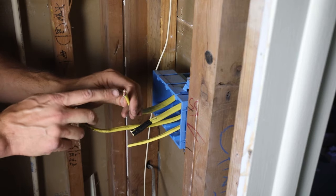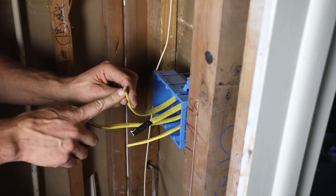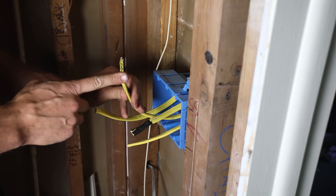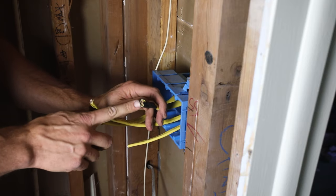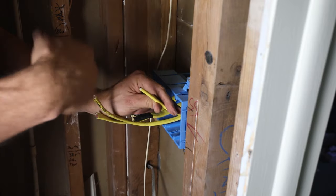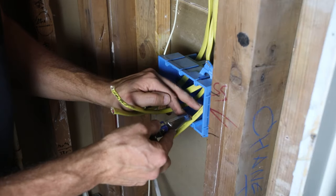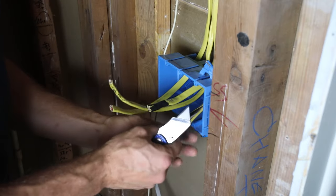This is the four-wire assembly going out to both the main vanity light and the mirror light. This is the main power circuit coming in from the breaker box. There's also a four-wire setup that goes out and feeds the bathroom fan and shower light, and another that feeds circuits outside this bathroom. Now I need to tie them all together. I'll strip back the wires with a light score mark in the middle and pull the sheathing back.